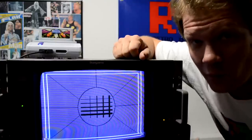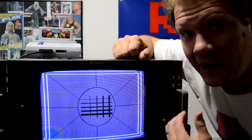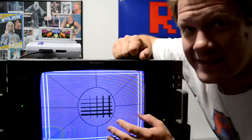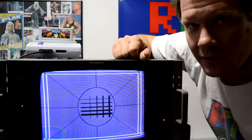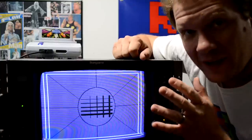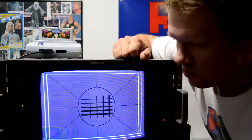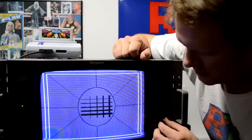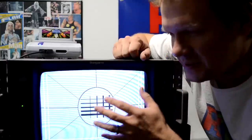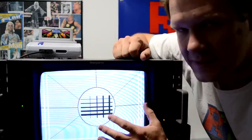This is by far the oldest professional video monitor CRT I've ever had the chance to work on. This is an Ikegami monitor from 1987 — it's a pro monitor that does RGB as well as other standard video inputs. I wanted to get it on film because I've just fired it up to start looking at it to restore, and we have kind of a weak screen. It has been flickering a little bit, which is a telltale sign that the capacitors inside really need to be replaced.